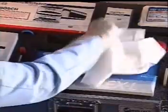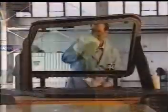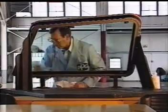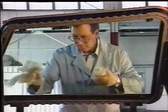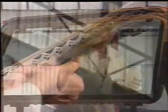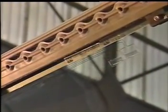Next, remove several disposable towels and the cleaning solvent from the master kit and remove all of the visible haze from the aircraft windshield and any residue from the tape. Make one pass with a wet towel and one with a dry one. After all of the haze has been removed, wash the windshield with deionized water and dry it with disposable towels. Once you have completed the coating application process, be sure to tag the windshield with the appropriate identification label.